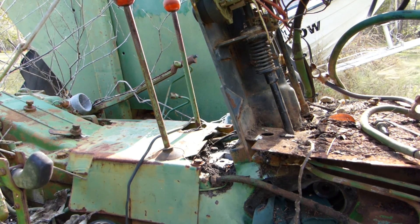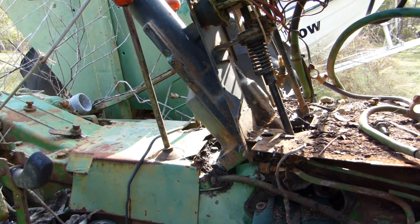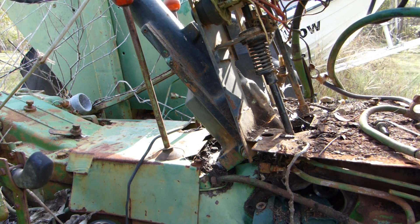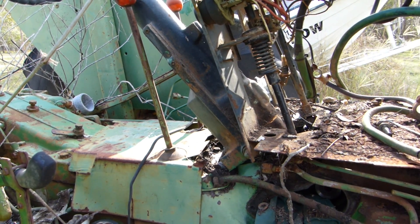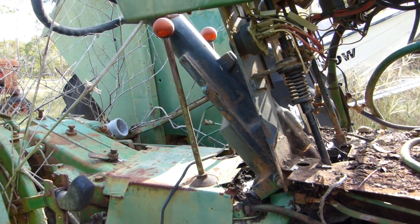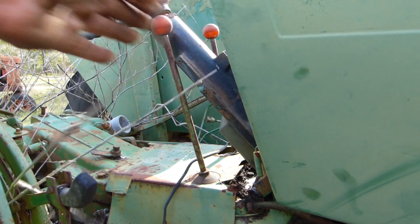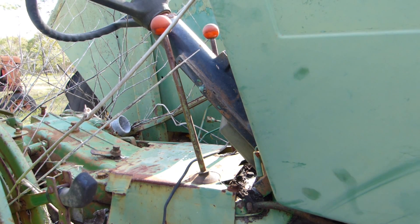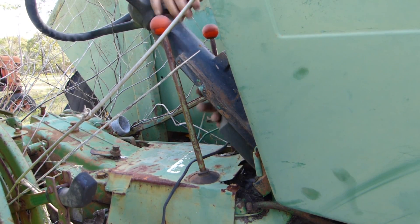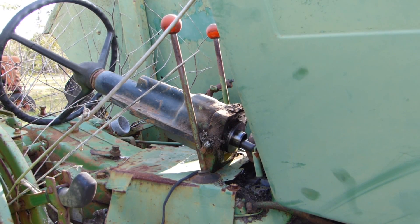All the bolts are out now, so that column should be quite loose. When you do yours, make sure you clean all the junk around here. Being an old tractor I haven't worried too much about it — if we continue with this old girl we're going to go right through it. Bring that down out of the way, and there's our steering column. We'll go around the back — they're quite heavy. And there's the column, there's what we call the dog bone.